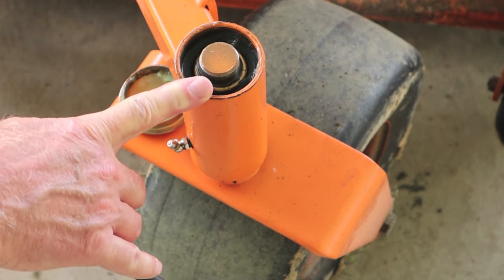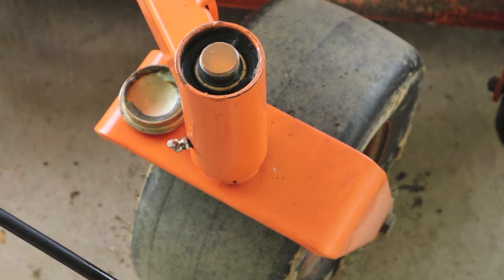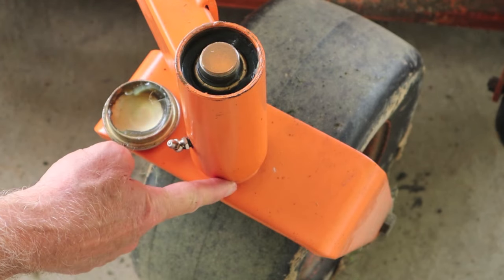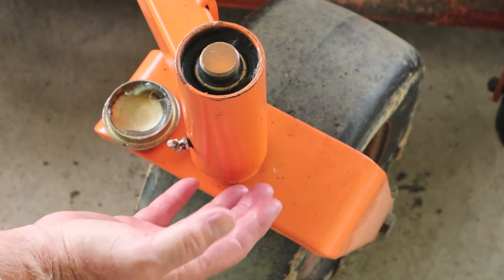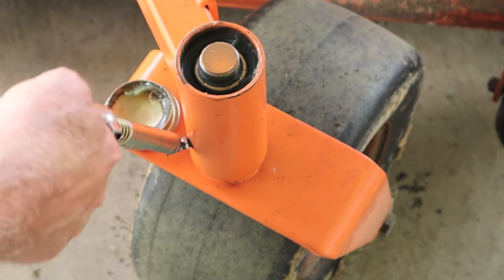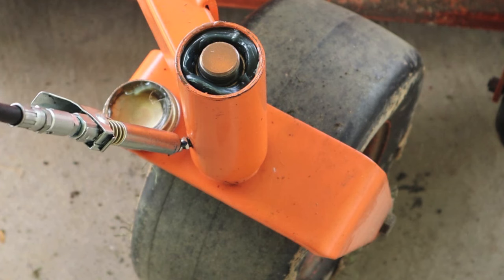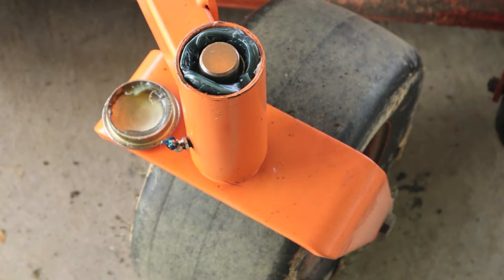One thing — I have not been doing this according to procedure. You should remove the cap first. You just saw it had old grease in it. To get the new grease to work up through there, that old grease — if the cap does not pop up — obviously has nowhere to go and never comes out the bottom. I'd love to see what kind of seal or retaining cup Scag uses to keep the grease contained in the king pin. So let's do it the way they want you to do it. I'll go a little bit more, clean that out, and we'll call that good to go. I am going to leave my Zerks in it because I'm the only one that greases this machine.